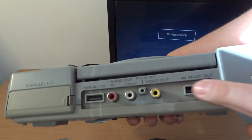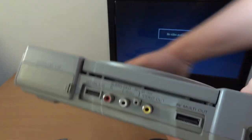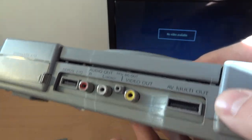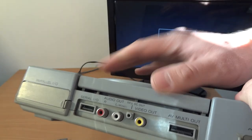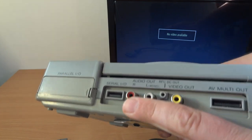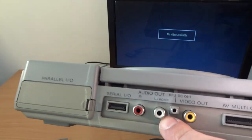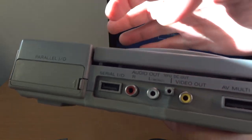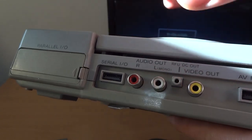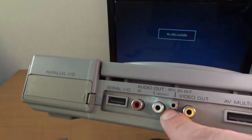The important part for this video is this video output. Generally speaking, what you want is a cable like this that connects to your TV with a SCART connector — basically RGB output where the colors and image clarity are perfect. If you can't have that, you would use this video out. And if you didn't have a stereo TV at the time, you'd connect only the mono cable — this is composite, so the quality is not that great.